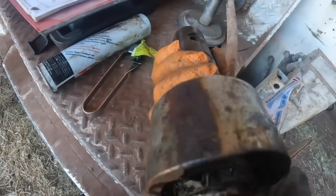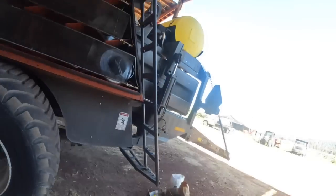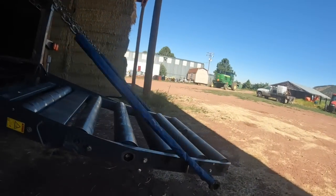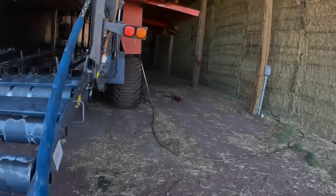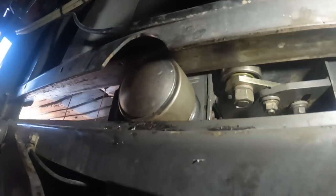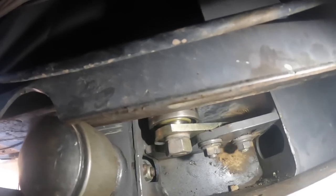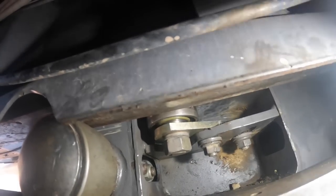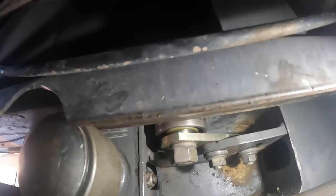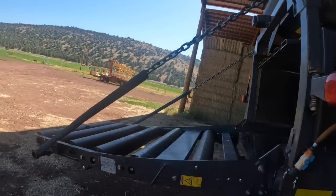And I already had one of them that was already set up with the shaft and everything that I put in on the other side. Over here, and what a difference that made, huh? I'm telling you, what a difference that made. But I got that one new in there, and I got the new side roller in there. You're supposed to have a 16th inch clearance with the plunger all the way at the back, so I'll have to move it all the way to the back and then readjust it. But we'll climb in here and I'll show you what you've got to do to get them loose. They're a pain in the ass.